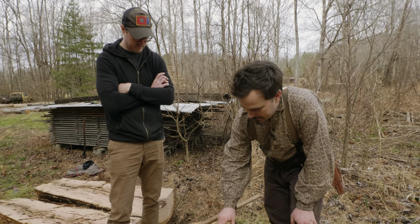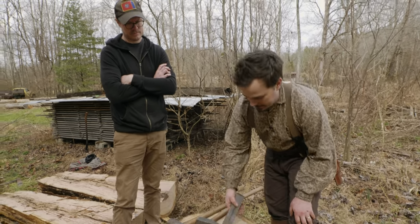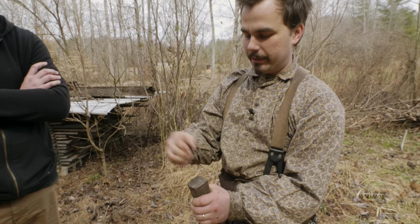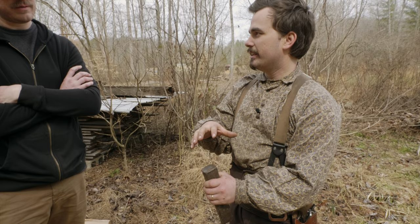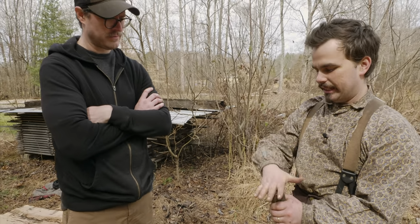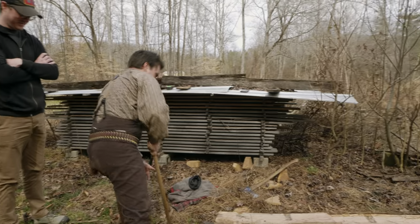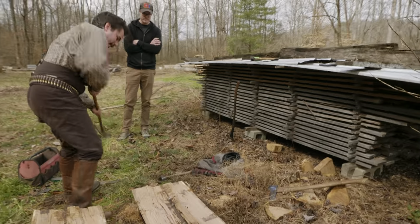And it's my theory that, all other things being equal, you get less mushrooming with a lighter wedge and a heavier hammer, because the mass of the wedge acts as an anvil, basically, for the mushrooming. The mushrooming's happening because the metal's soft, and that's where the most energy is being dissipated or expended in the end. And then the amount of energy that makes it through to a given point is less and less down the length of the wedge. So basically what we are doing is making a board without a saw.